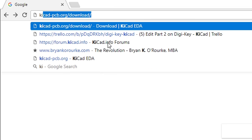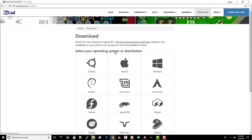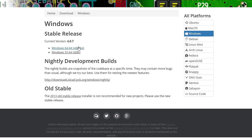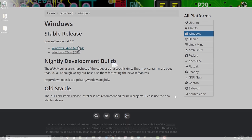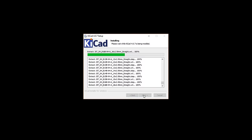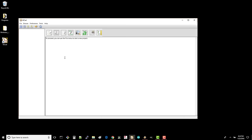All right, enough talking — let's go download KiCad so we can start making our board on the next episode. Head to kicad-pcb.org and click the big download button. Choose your operating system, which is Windows for me. For example, I'll choose to download the 64-bit version as I'm running a 64-bit version of Windows 10. Follow whatever instructions are necessary to install KiCad — this could include running the Windows executable, installing the disk image on macOS, calling apt-get in Debian, or building it from source code. If presented with installation options, keep everything the default. Open KiCad and you'll be presented with the project manager. We'll create our 555 timer badge project here and begin designing our board on the next episode. I hope this has given you some insights into how and why PCBs are made. See you next time!